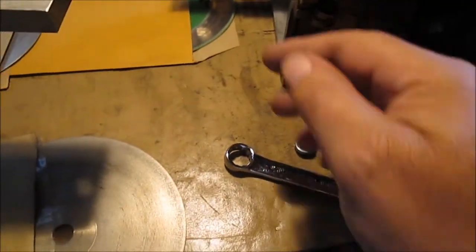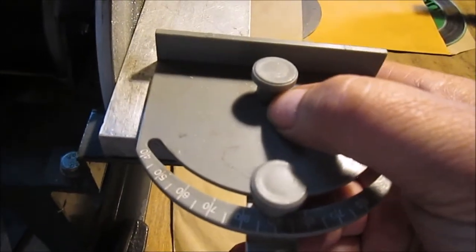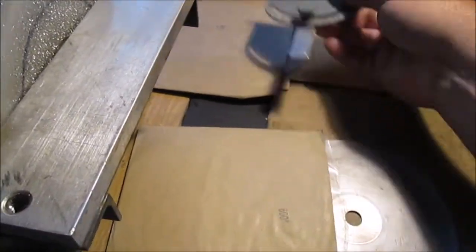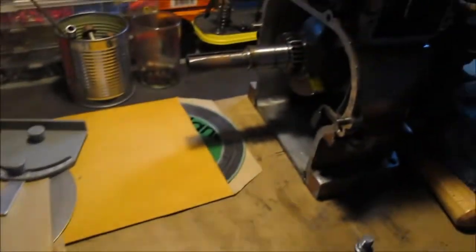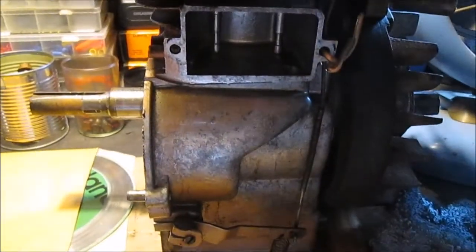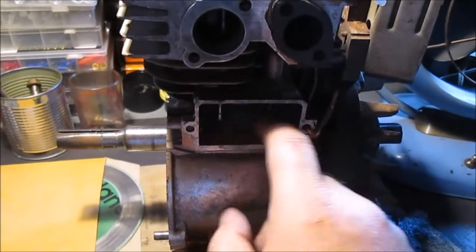There's a little bolt that goes under here, and there's a little cutout where it clears the hub. It goes over here, and like I showed in the last video, there's a little rig up here to keep a 90-degree angle — this is actually off the machine too. I'll show a little clip of grinding the valve on there, just a short clip. We'll get this job done, start to put the side cover back on with the cam and everything, and the tappet is back in so we get our clearance. We had them out so there was nothing in the way when we ground and lapped these valves — when you're grinding valves, you don't want them in there.